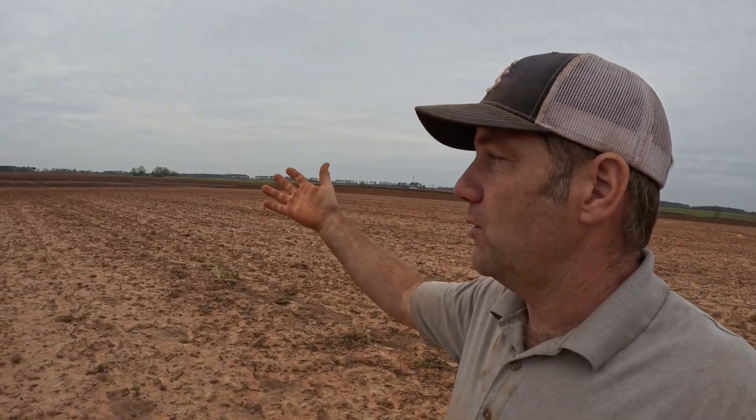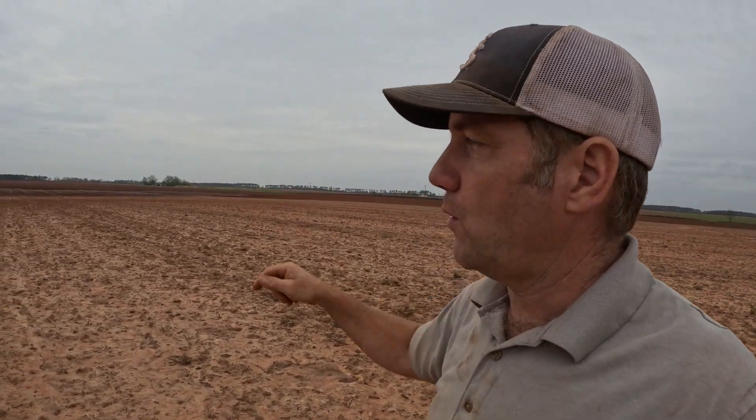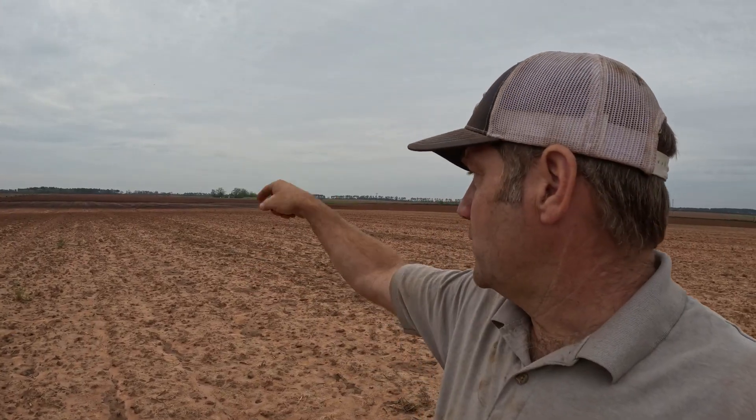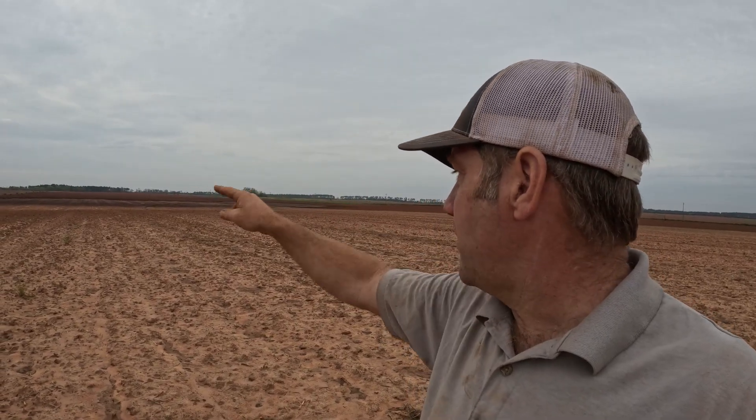Right now I'm having to turn around at this large bottom because it has become densely packed and water is standing on it - it's too muddy for me to go across. The top 10 or 12 inches the tractor will bog in; it's slick and muddy, but underneath it's hard as a brick bat, making the water stand. If I can get back out here before we plant the corn to run the subsoiler through that bottom, it won't hold water throughout the crop season and I'll be able to plant corn right through it.